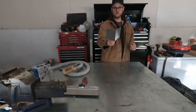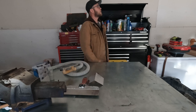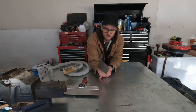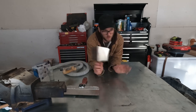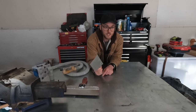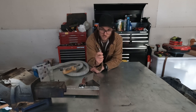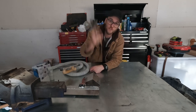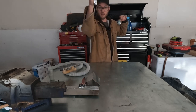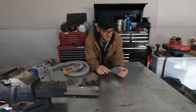Corner trowel — this is for an inside corner, pretty self-explanatory. Leave your opinion in the comments: are you a corner trowel kind of guy, or do you think it's a gimmick? I love the corner trowel for the first couple coats. For a finished coat, I'm just going to take a regular drywall knife and finish the corners one side at a time. If you do one side of a corner while it's wet and try to do the other side with just the knife, the corner doesn't turn out awesome.